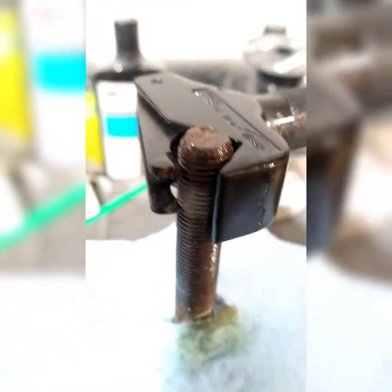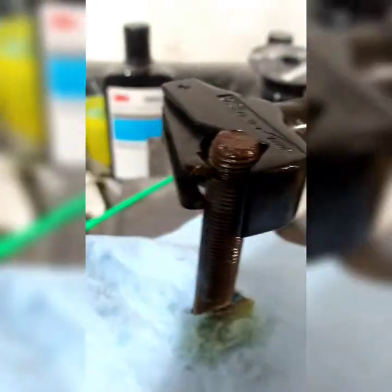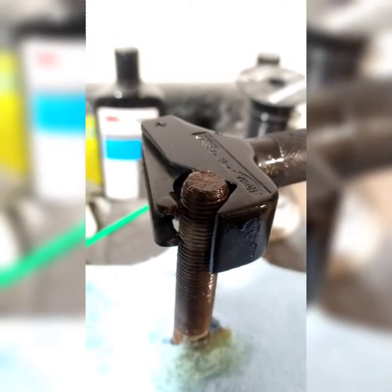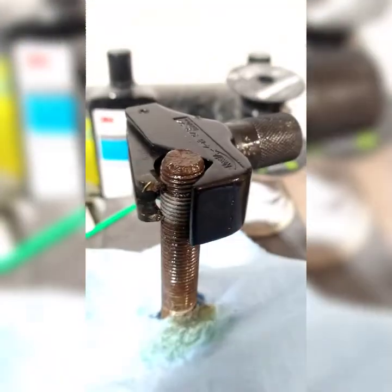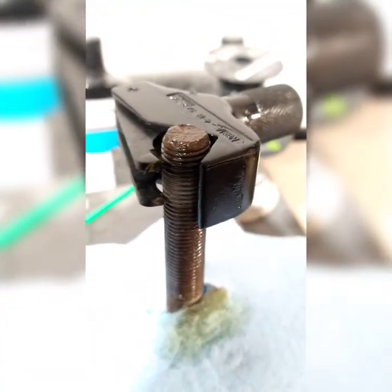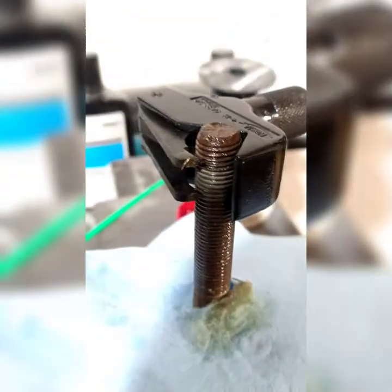I plan to do this, so the way I play with this stuff is, before I take off a rusted bolt, I try to put this on, or a tap on, or a die on. Because I want that bolt to come off as clean as possible and not mar over the threads and not gouge itself and all whatever. You know, I try to work as clean as possible. But I'm in one of the rust belt states, and here we go.